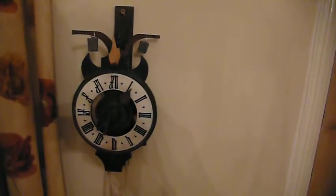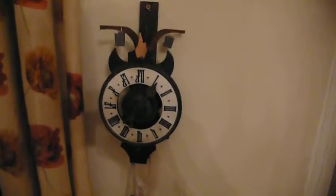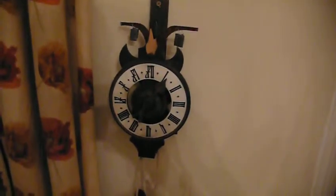These weren't the most accurate of clocks but they were pretty good. So if we move that weight a little further in, this will speed the movement up — the release mechanism will go quicker. And obviously as the weight descends it's working the mechanism, and obviously you can put it back up when it's gone all the way down — it clicks back up into place. Depending on how long your rope is, the length of the rope will dictate how long the clock will run. Some of these big old ones in the cathedrals would be running for over a week, and you'd have to wind it right up and then it would go for a week.